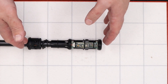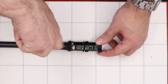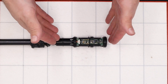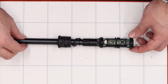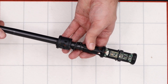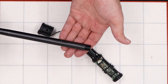If we needed to remove the entire chronograph assembly, it'd be very easy to do at this stage. We'd locate the two grub screws in the back boss and gently remove them using a two and a half mil allen key. Once the screws are loose we can unscrew the entire front section of the chronograph carefully. These can come fairly tight from the factory, so you may need to grip the barrel in a device with soft jaws to not mar the finish. Then, keeping the back boss in relation to the front part, gently unscrew it and slide the o-ring up the end of the barrel.